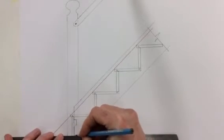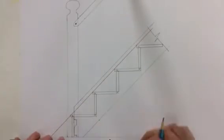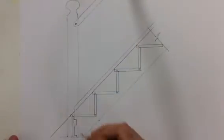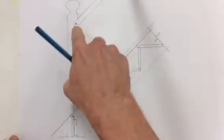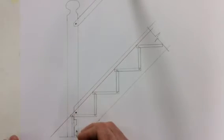I see you'd have a tenon, something like that cut out, a little bit peculiar in fashion. But it would be slotted into that 100 by 100 piece. Again, like your handrail, a dowel went through there. Here you're going to have two dowels. So you'd have one dowel positioned there at that section of your tenon, and then another one down here. So that fixes that in position.